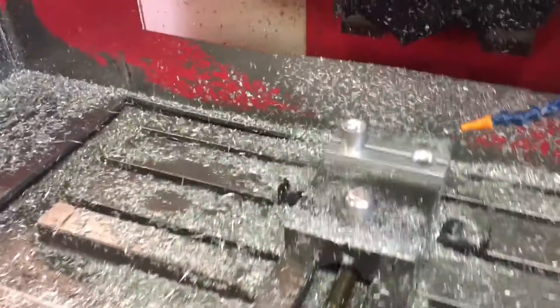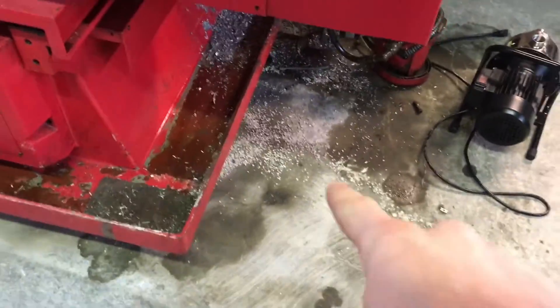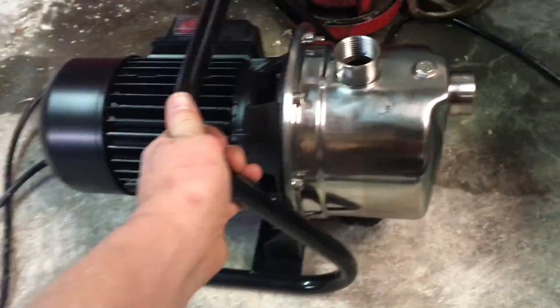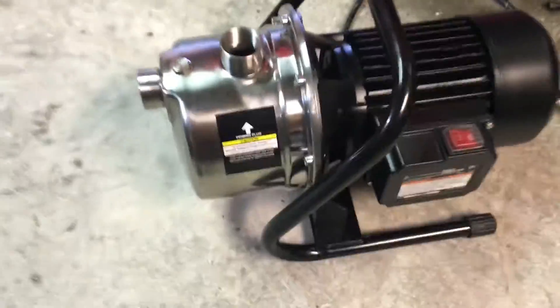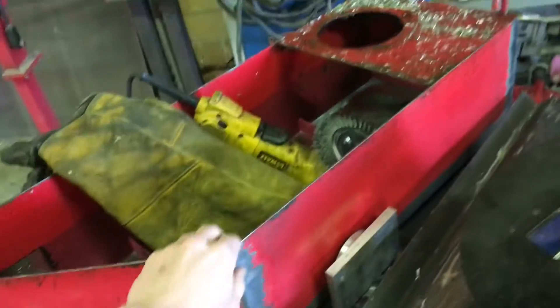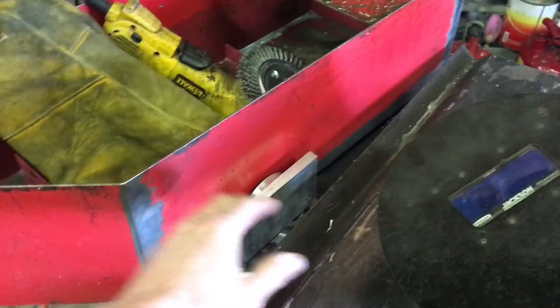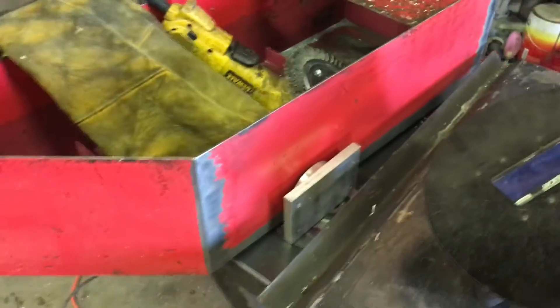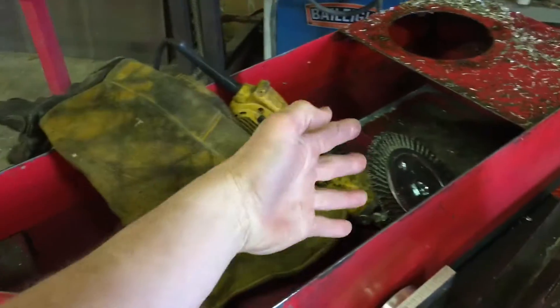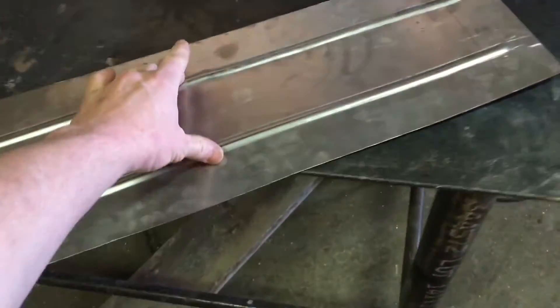I am overhauling my coolant system today. I pulled off the sump and bought this pump from Harbor Freight — a one-and-a-half horsepower sprinkler system pump that'll generate up to about 35 psi, which I think will be plenty. I'm adding on to the coolant sump here, building a box that the pump will sit on top of. Without it, I'll drain all the coolant before it has a chance to flow back into the tank, and the pump will run dry.